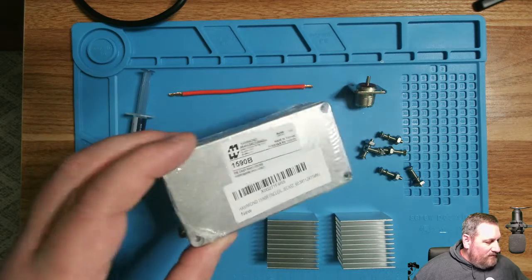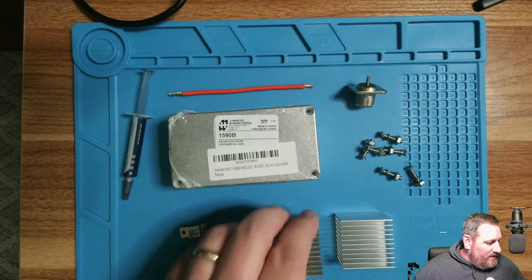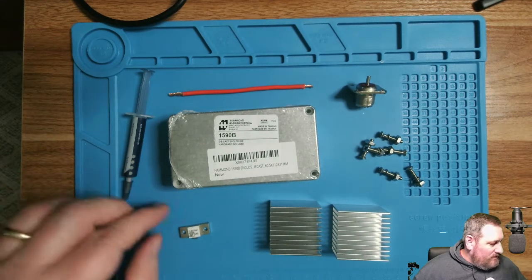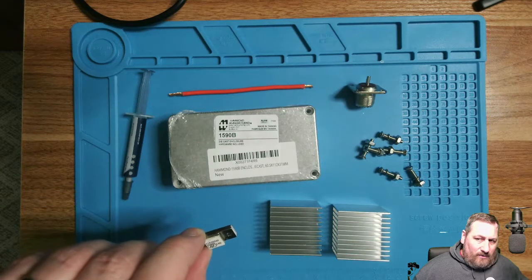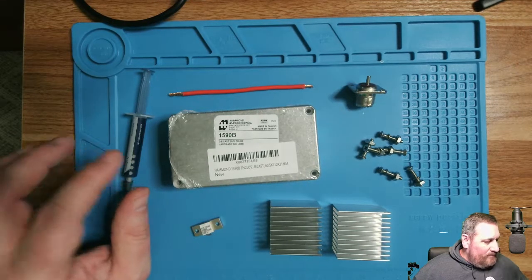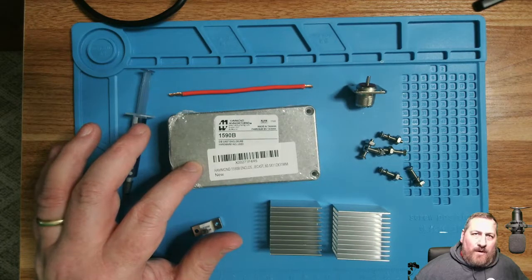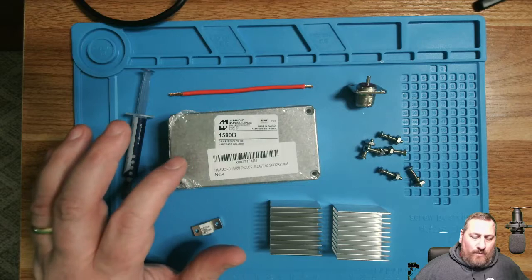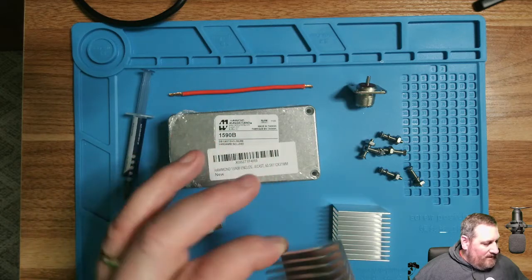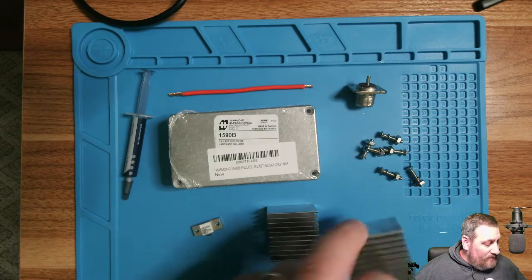I've got a Hammond aluminum die-cast case. It's the 1590B. I got some heat sinks. You don't have to use heat sinks on it, but I might just to do that. And right here's my 250 watt 50 ohm resistor. The case, the Hammond case, I got off Amazon, and I'll share the links below in the description. The case I got for $6.99. The heat sinks, if you desire to do it, were $10.99, and there's four of them in the package. I've only got two laid out.